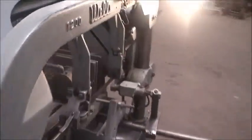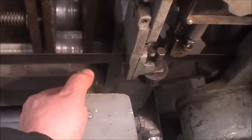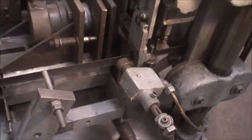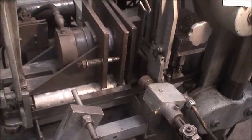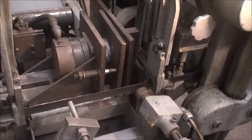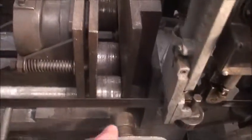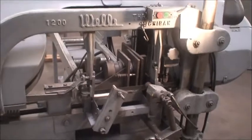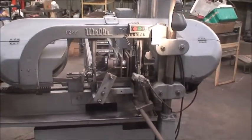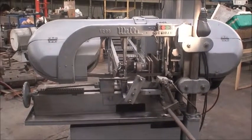So what I'll do is I'll activate — the vise is open right now, waiting and feeding parts in. What happens is it'll hit this limit switch and start the cycle. The vise closes, the stop moves out of the way, cuts the part, the head goes back up, the vise will open, and it will feed material until it hits the stop again. That's the cycle of the machine and what we'll do now is we'll take a short break and set it up so we can actually cut a part. We'll be right back.